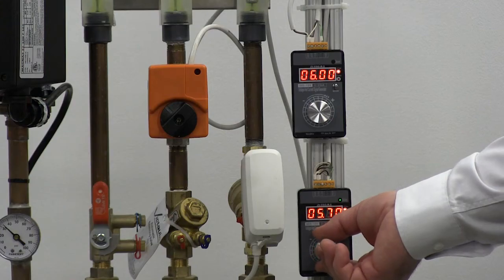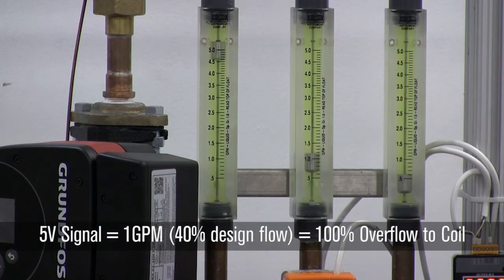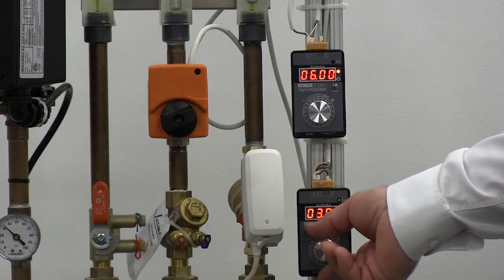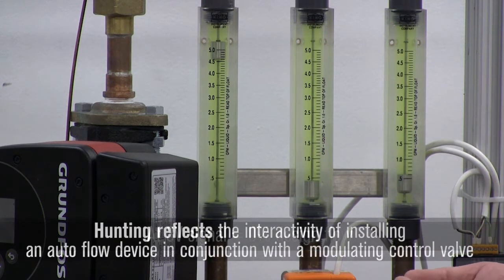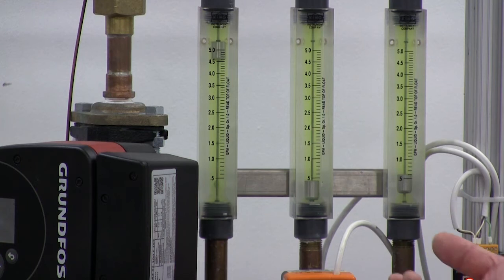Let's see what it takes to get down to 20 percent. We're still at about 40 percent of our initial flow rate, still not getting good control. If I go one step further to 3 volts, the valve closes completely and I'm getting no flow through the system. So what's happening is I'm getting bad control — I'm still using the thermostat to control the system, but I have a valve that either gives me good heat or cooling output, or gives me very poor output and winds up sitting there hunting all day.